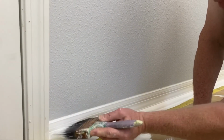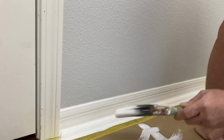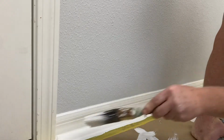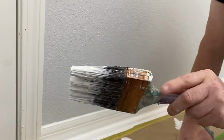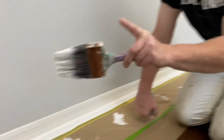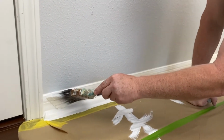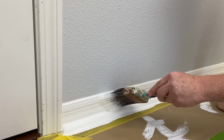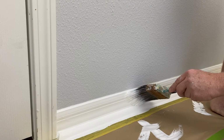This is self-leveling paint. It has a toleration in terms of time. You can work with this paint. This is Urethane Enamel from Sherwin-Williams. Now look at how I'm holding my finger. Watch this. Look at that finger. This is going to direct me. It's going to help my motor skills direct the tip of that brush just where it's going. See that? I can't do that if I hold the brush a different way.